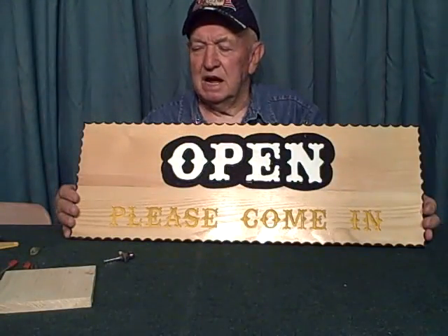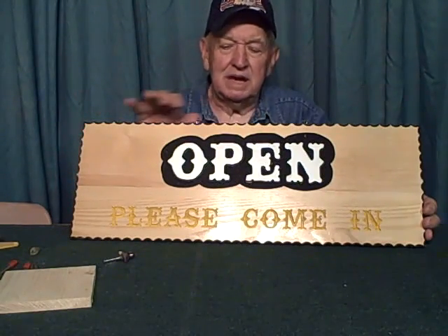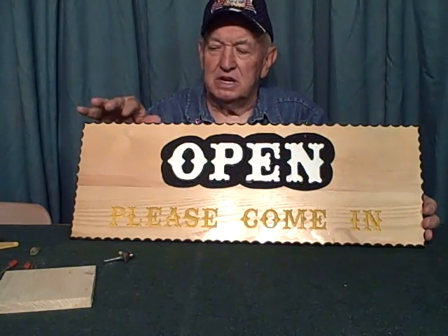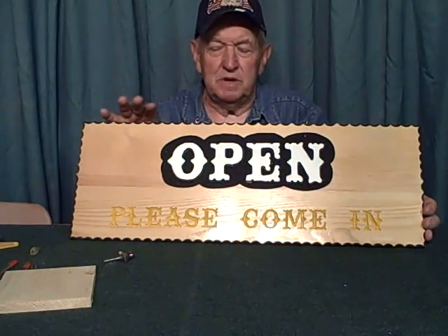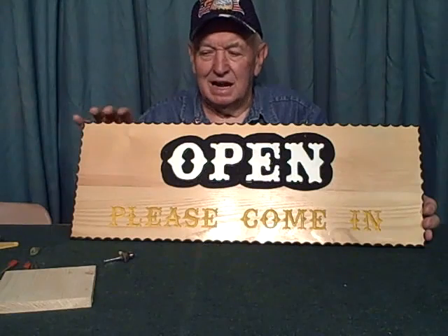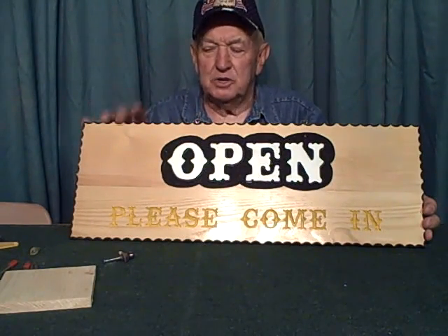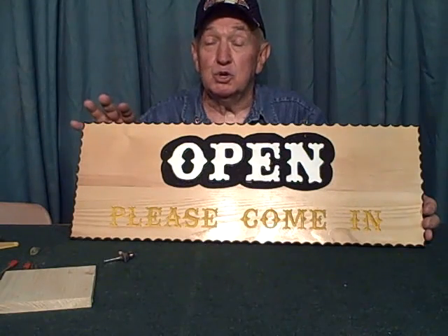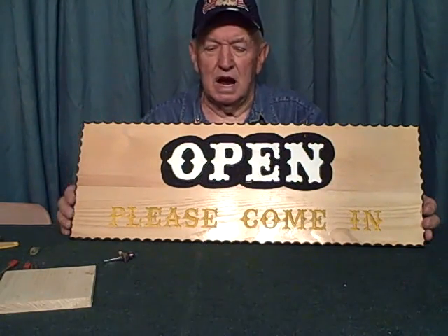This is just a general idea of what a sign looks like with a scallop. A scallop simply means these little dips that go all the way around. We do that with the chamfer bit we're showing you right now. Once the scallop is done on one side, we do the chamfer on the back side. I'm going to show you that on a smaller board and also show you how we set the depth so we know we're getting it right.